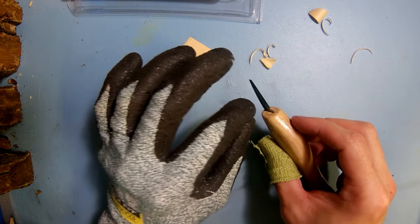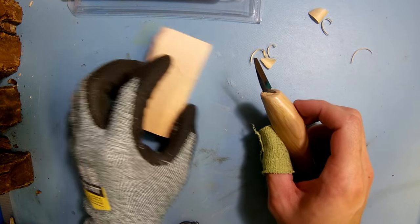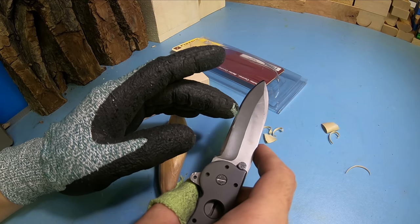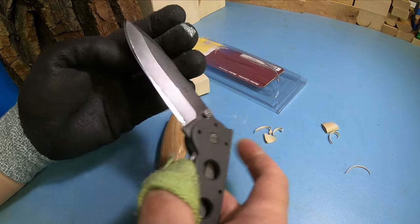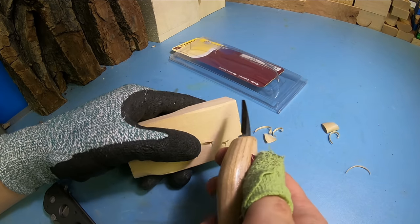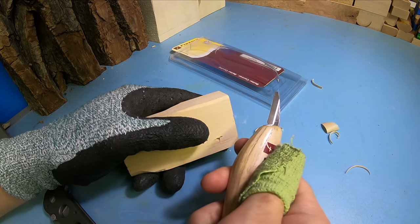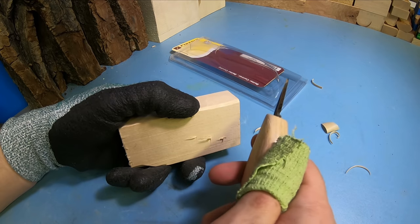The reason why you don't want to do that is because these knives have a very fine point, usually between 12 to 20 degrees cutting edge. Regular knives will have a steeper cutting edge which allows more edge retention for robust tasks, but they're not as good a slicer in wood. So if you're scraping along the side you're actually damaging that edge — always cut into the wood as the blade was designed. You don't ever want to scrape it; you'll just dull it out really fast.